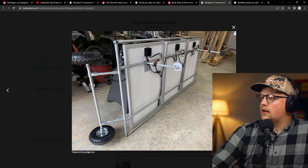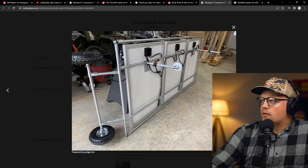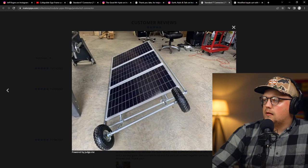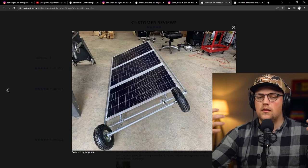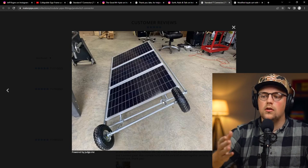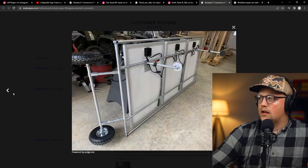He's got the wiring secured, and he can adjust each panel individually. There's an adjustable angle pipe coming off the frame connected to a round base — he sets those adjustable angle pipes to a certain angle and the flat round bases lean up against the ground. You could pull them closer for a harsher angle or spread out for a flatter position. It looks like it's working great and holding well — three panels at 17 pounds each is 51 pounds total.